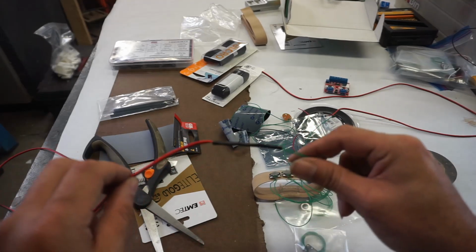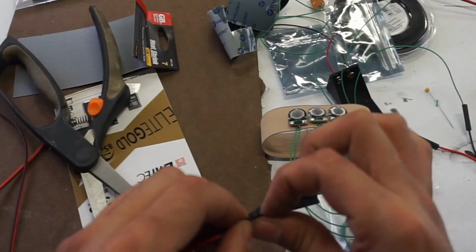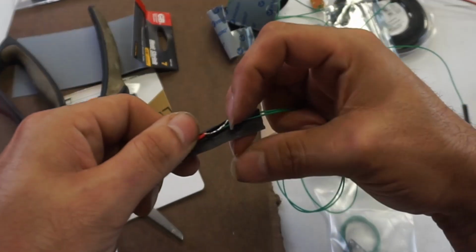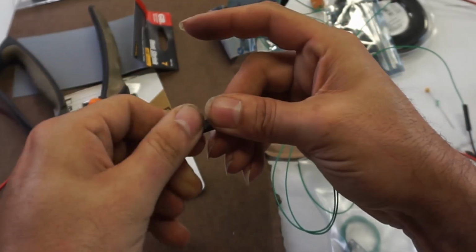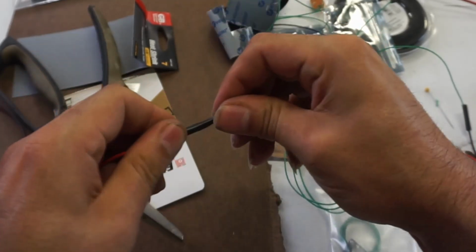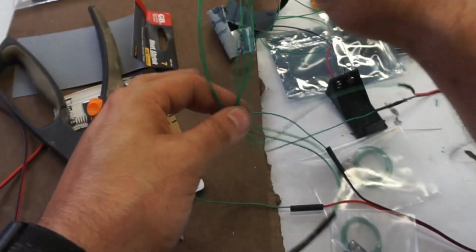You probably didn't catch any of that. So we're gonna take everything off and re-show you. Take one strip, loop it around, put the second one on, and then just roll it tight. I'm not worried about how well everything stays together because the whole thing is going to be in one large heat shrink tube, which is where we're at next.